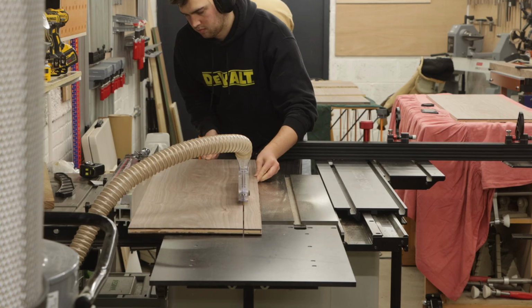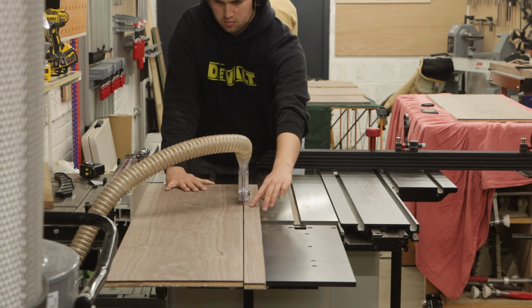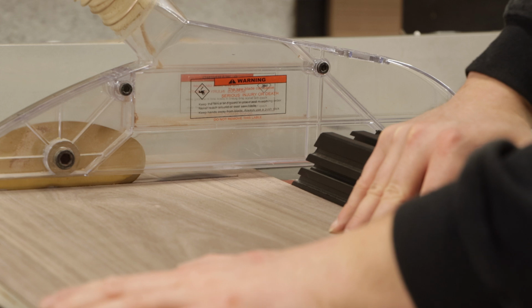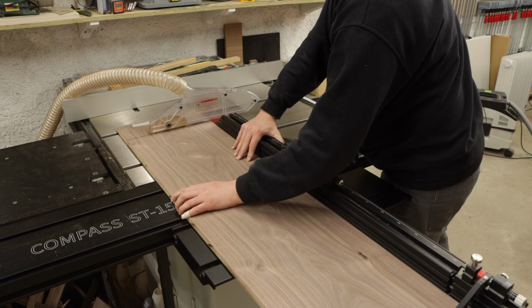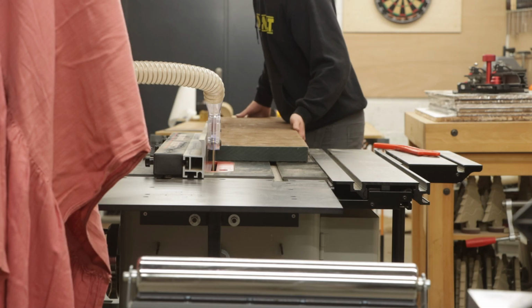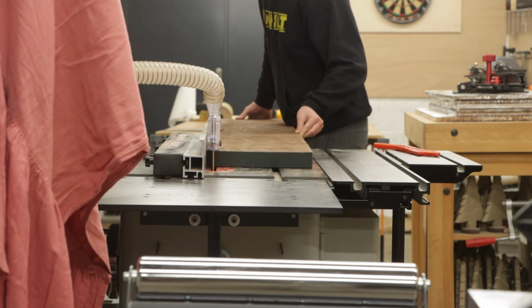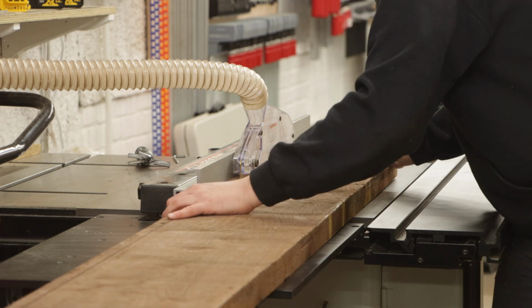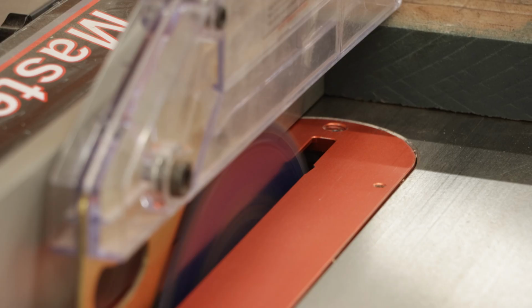Now, I've actually heard people say vacuum bags are not strong and don't veneer well, but honestly, I think they've never used a vacuum bag. The amount of pressure they produce is immense. They actually produce 8.5 tons of pressure per meter squared, which is more than enough pressure to press veneer down onto a board and even curve veneer around a mold for a bend lamination.